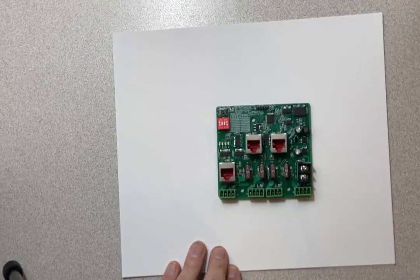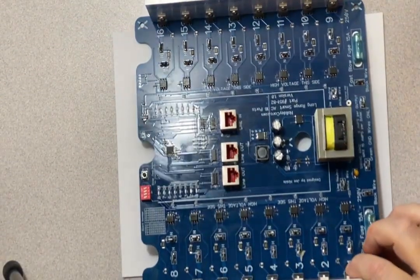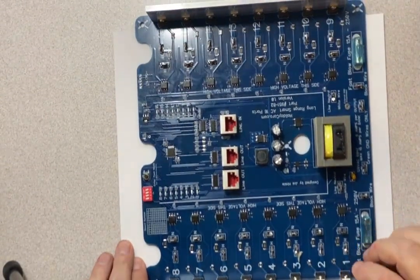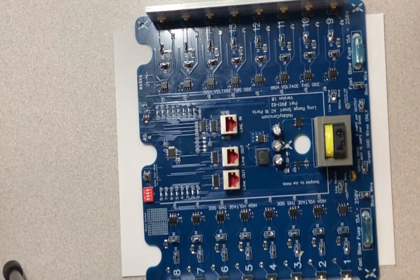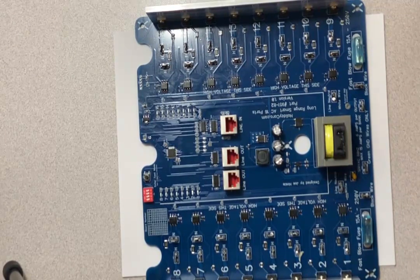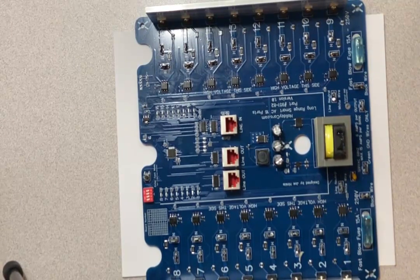That's not the only long-range technology we have. We also have AC technology. What you can do with this board is take one of the 4 streams of data, and identify 6 pixels that will be extracted from that data stream. Those 6 pixels become 16 AC channels. You've got a full-fledged 16-port AC controller based off of pixel transmission.